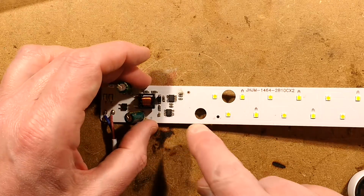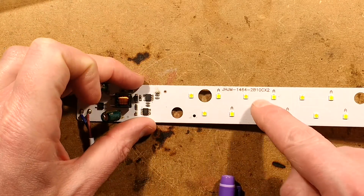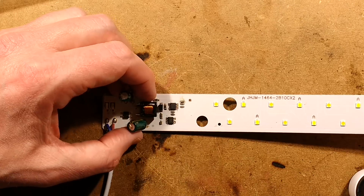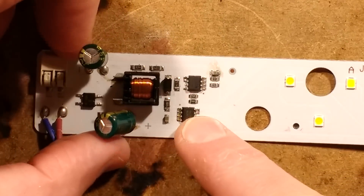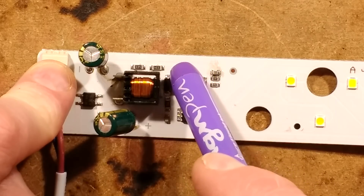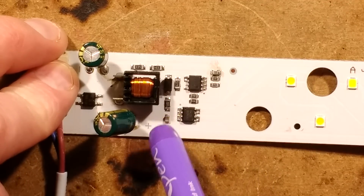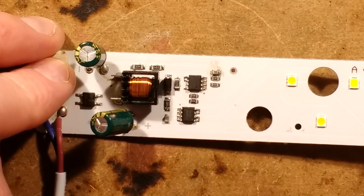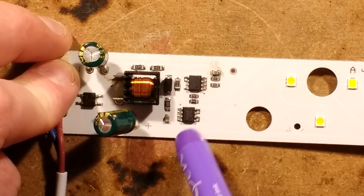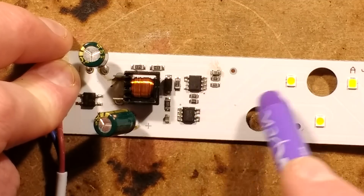Its function is very clearly to switch the two sections of LEDs. The LEDs are actually wired as parallel pairs — each of these pairs of LEDs are wired in parallel. There are 10 of each, which gives about 30 volts across each LED circuit. This little switching chip has a resistor feeding it as a signal, I'm guessing from the positive rail, so it can detect when the power is turned off and on again. It's also got a little reservoir capacitor to hold the memory, toggling through outputs: one, two, or both together. The four pins on this side of the chip are commoned as two pairs, each one driving a string of LEDs.